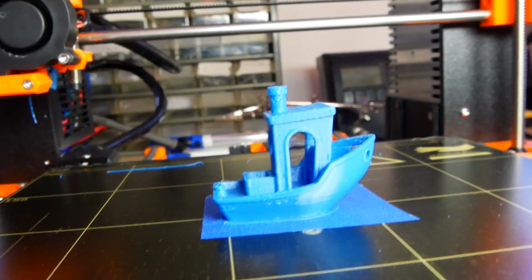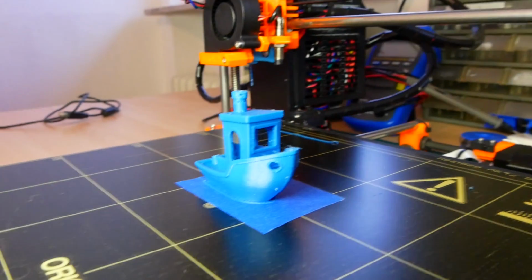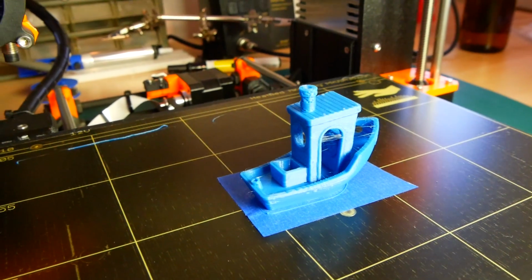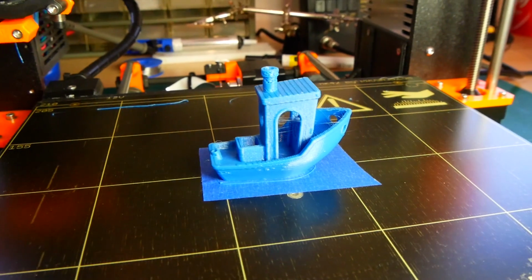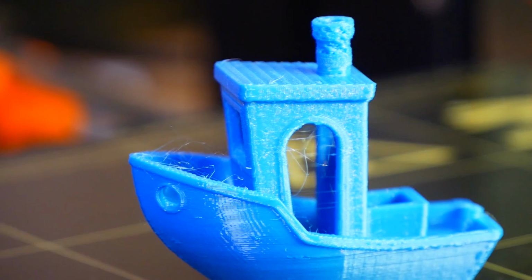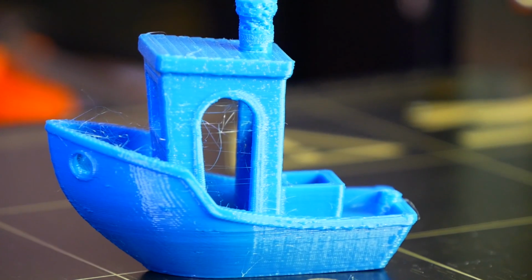In conclusion, I think the results are quite similar to other brands of PETG material. The great bed adhesion might be something which you might really benefit from because less prints might fail. Axial strength was good, layer adhesion only okay. The print quality is unfortunately still far away from PLA due to artifacts and stringing.